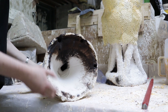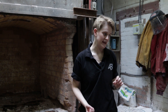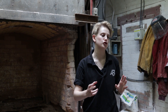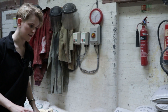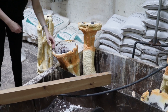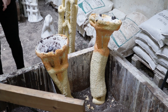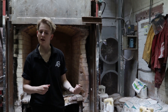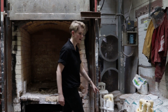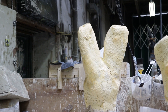It's the fused silica — the fused silica particles within the tank and the grit that we apply convert into a ceramic at that temperature, which makes each shell strong enough to withstand the pressure and temperature of the bronze being poured into it. The wax has started to be melted out — they've taken the cup out and it needs to go back in to be fully melted out. This whole pit gets emptied into giant buckets, and the shells that have been fired and are ready get buried in this pit with the cup at the top, ready for the bronze to be poured in.